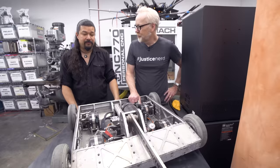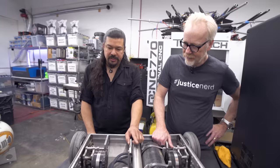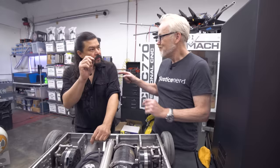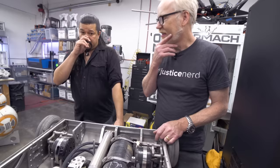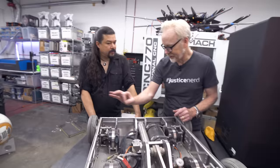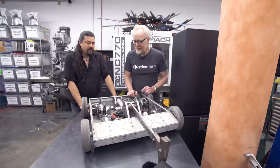There were all those teachable moments. There was one match where Dead Blow caught on fire inside the speed control, because there was a shaving of aluminum that shook into the electronics, causing a short and catching it on fire. The subtlety of that — how could we have ever foreseen it? But there was an open top and this little thing found its way in. That's all it takes; it's always the most unlikely thing.